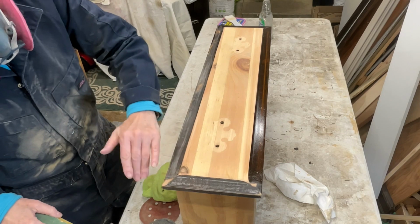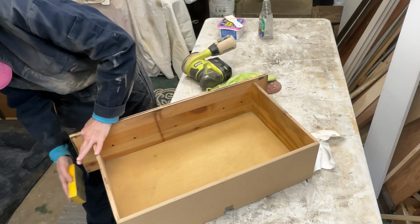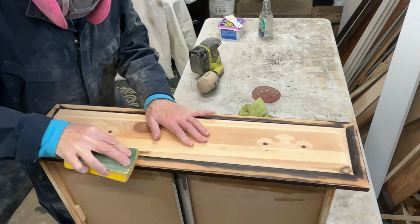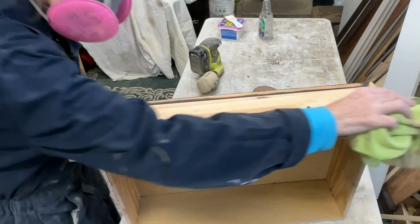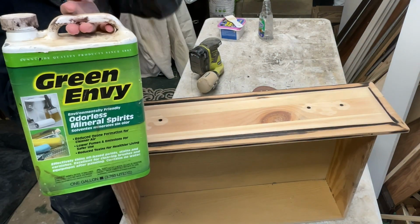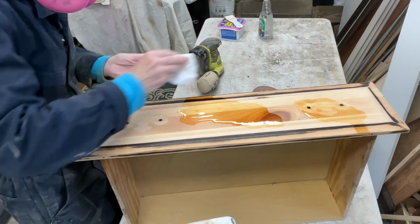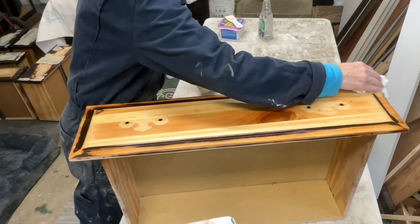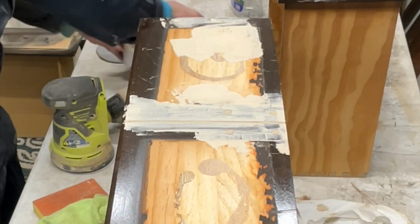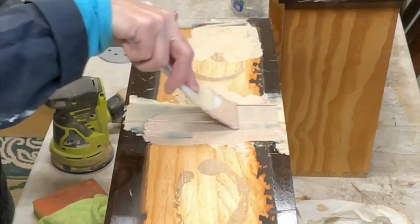I wanted to show some wood, so the bottom 2 drawers and the top I was going to stain. But I did have some issues because the wood was so soft. So I used mineral spirits on the wood I was going to stain to raise the grain. That way, any scratches I created from my orbital sander would sand off after the grain had been raised. More on that later.